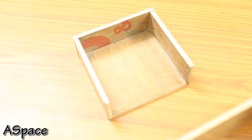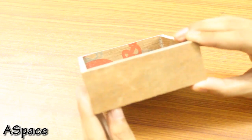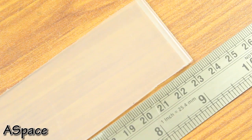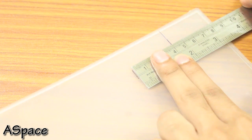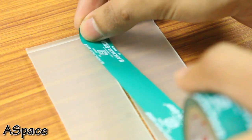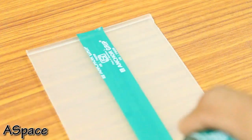After the glue is dry, the end product will look somewhat like this — I haven't placed the fourth side yet. Another key material for this project is an acrylic sheet with a thickness of 3mm. I cut 3 pieces with a width of 4cm and a length of 22cm, which will form a triangular shaped frame. Align all 3 pieces adjacent to each other and with electrical tape stick 2 pieces of sides together; repeat for the remaining piece to complete the triangular shape.